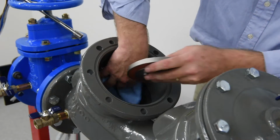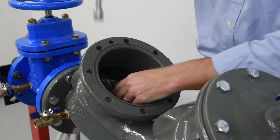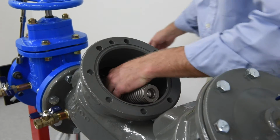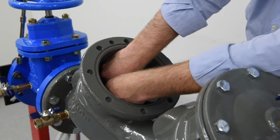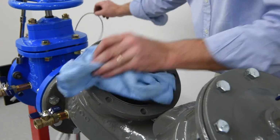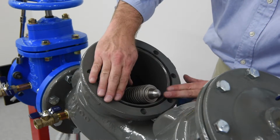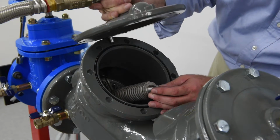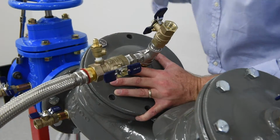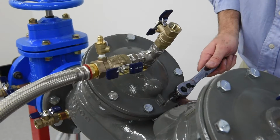Reconnect the check disc assembly to the arm by rethreading and tightening the jam nut and washer. Note, when the jam nut is tight, the check disc is designed to wobble. Reconnect the spring assembly by replacing the load pin and retaining clips. Reinstall the pivot bearing. Replace the cover O-ring, lubricating as needed. Reinstall the cover, aligning the pivot bearing to the bearing socket and retainer pin to the retaining pin hole. Rethread bolts in a cross pattern, starting with the 2 bolts on either side of the retainer pin. Torque wrench tight in a cross pattern to ensure the cover is evenly threaded.